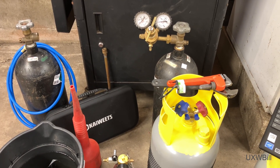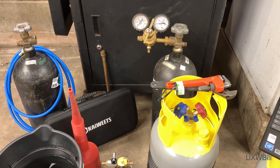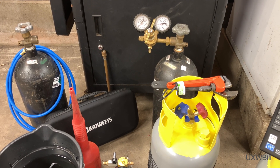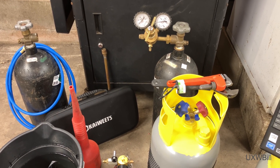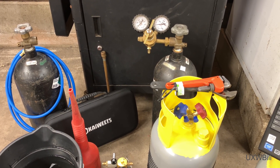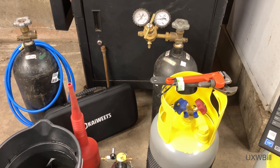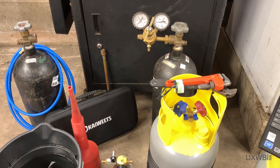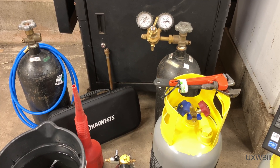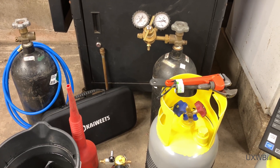The problem it has — and I'll bounce this off those of you in the viewing audience who happen to be a little more experienced than I am — is one of approximately normal head pressure but very high suction pressure, like around 116 psi or so. My first thought was that maybe the expansion valve had failed wide open and was dumping refrigerant just as fast as it would come into that evaporator. Looking back at that now, I realize that was not the right train of thought, not the right line of troubleshooting, and not very likely to be a symptom of that problem.